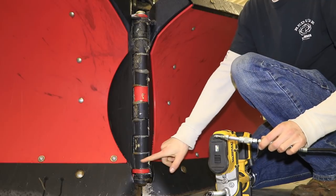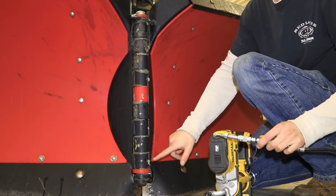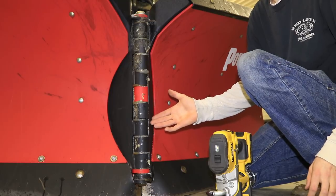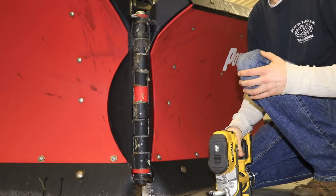You can see every single center piece has got a grease area in it — you can see where I've already greased. They each have independent holes to grease all the way up and down the front of this plow. This is obviously only on V-plows because this is the point of turning and swiveling in the front of the plow.